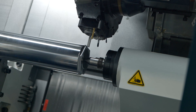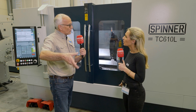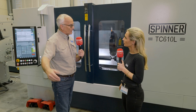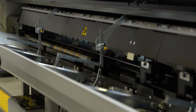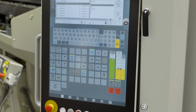So why have you gone for 16? Because with 16 tools you have more capability — you can have redundant tools, so if you're making long cuts and you burn up a tool, you have a second tool already prepped and ready to go. Or you can have tools already set up for the next job. And it's automation ready — we can get bar feed interface and robot interface, so you can auto-load this with bar feed or with a robot.